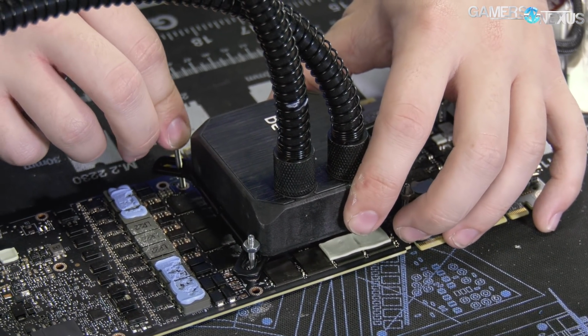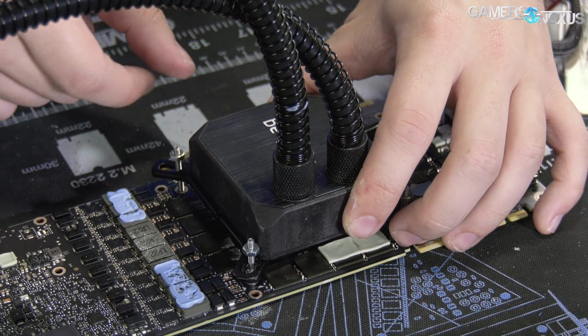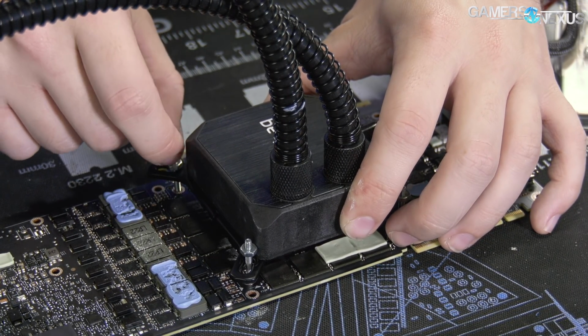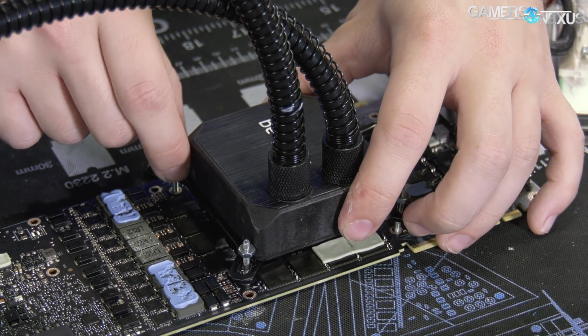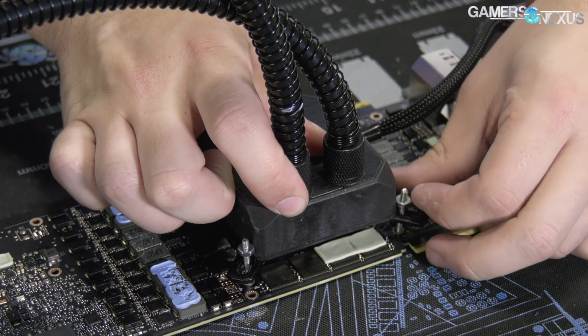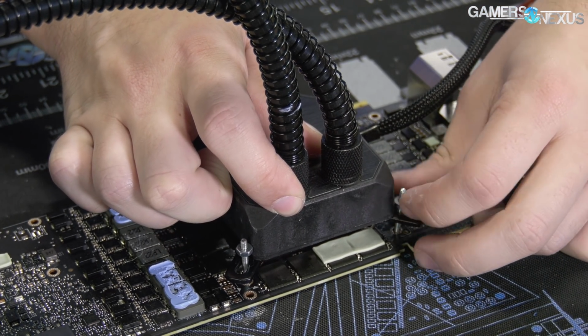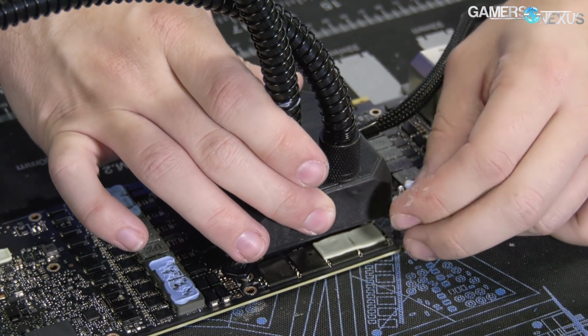You see it's kind of moving around as I'm applying that, but because we put so much thermal paste on there, I'm confident that there will be enough where we're not lacking coverage in any particular spot and potentially exposing the die to permanent damage. So we'll be good on that. And then again, VRAM, that'll be cooled by direct air and direct air only.